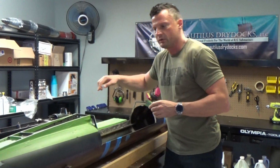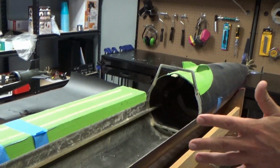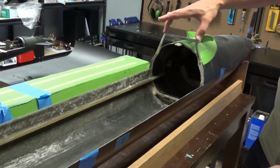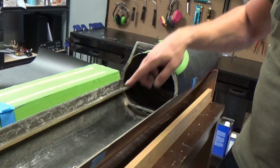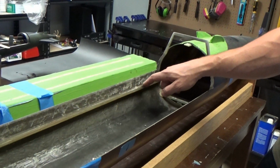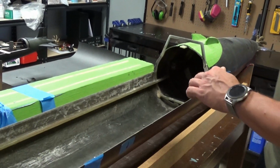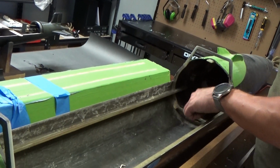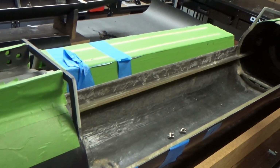and if you want to come a little closer here, you can see that again, the construction is absolutely gorgeous. We've got fiberglass bulkheads that actually extend all the way up to the profile of the missile deck in there. And we've got the stiffening versions of those down the sides as well. You got drains in the bottom with mesh on there to aid in draining. I would certainly open those up significantly though.